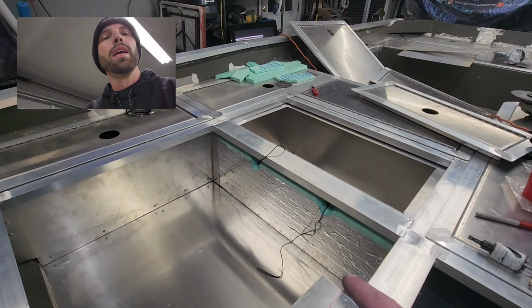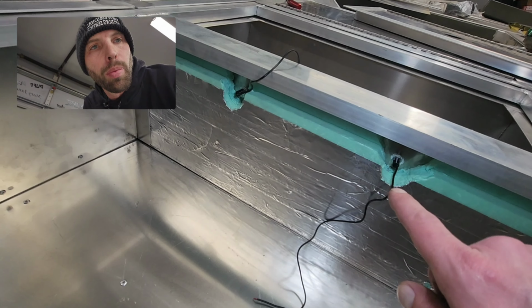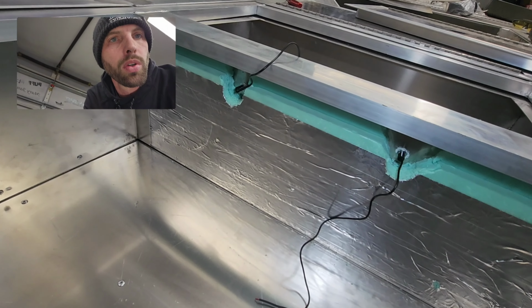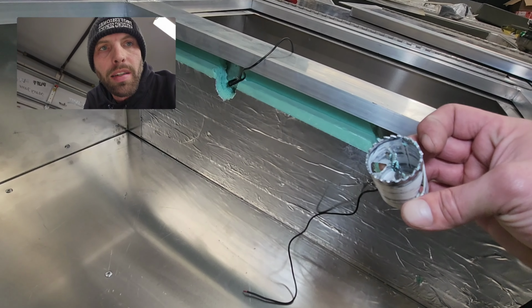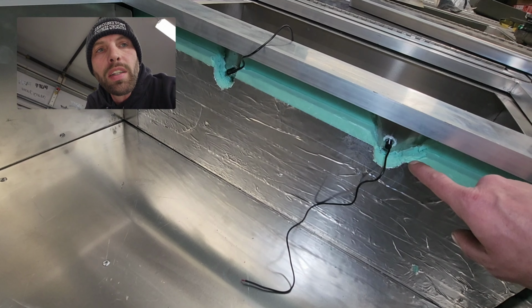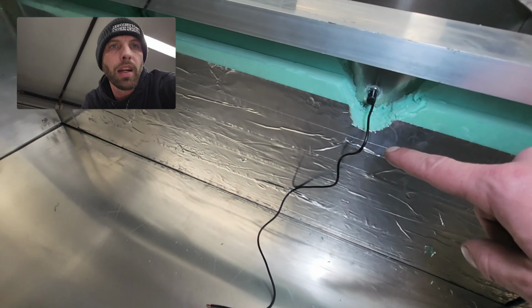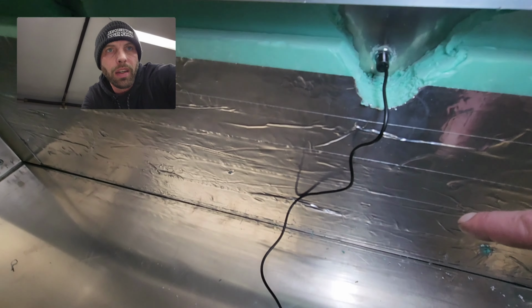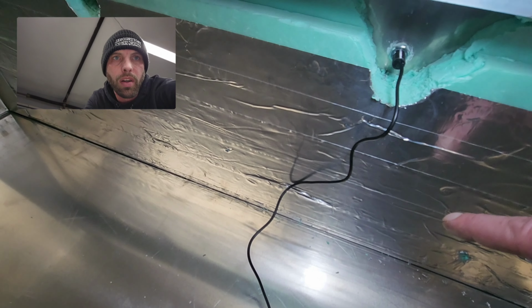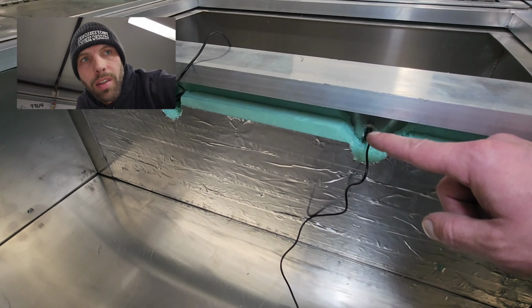And then on the backside, once I ran that 3/16 drill bit through the back, I came back with a hole saw bit. This one right here, it's 1.5 inches. And I just ran that back through this foam. Now the whole reason for that is because I needed to get this foam cleared out of the way in order for me to put that nut in there. You can see the nut is sucked up tight and there's some white 3M 5200 on the backside. So it definitely seeped through good and it's gonna seal this thing up nice.